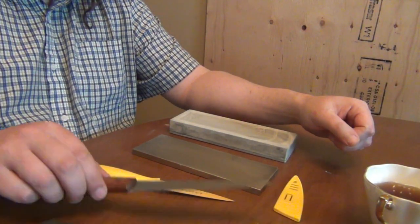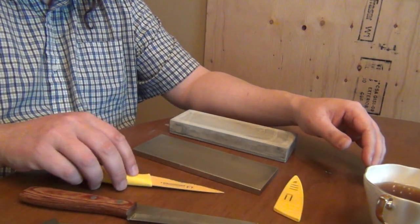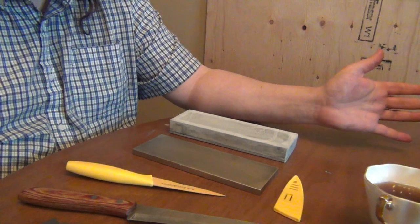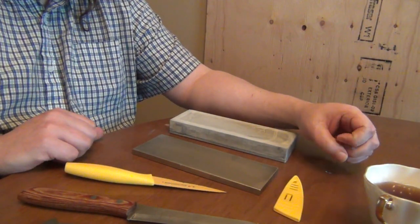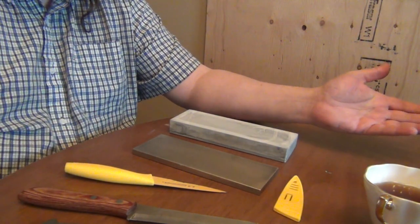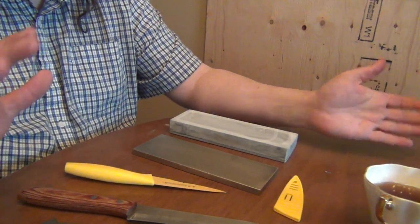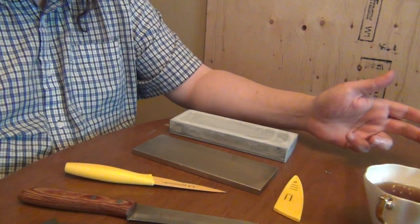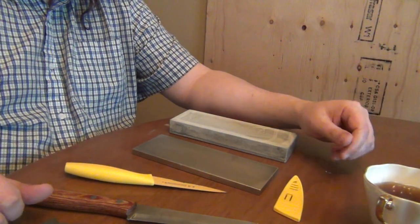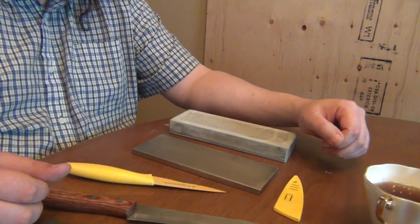It might surprise people to know that the steel in this is probably not even twice as strong as the steel in this. And if you look at other properties like wear resistance and even toughness, they don't change by massively tremendous differences, even when you go to relatively big steels. Large differences in toughness in a lot of these cutlery steels can be something like 20 to 40%. Steel strengths generally are about the same, and wear resistance is roughly about the same. Now, if you go really different in steels, like you look at toughness of M2 versus S7, then you can get much bigger changes. But strength usually changes on a much smaller difference than that. So around 5 to 1.